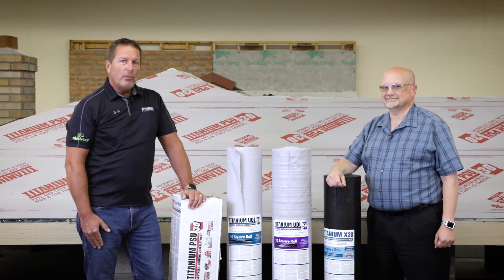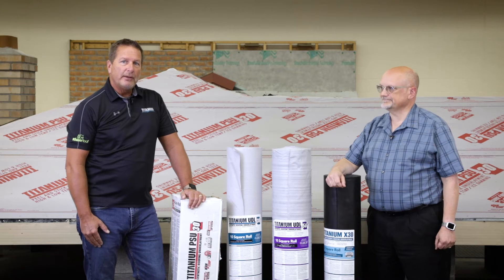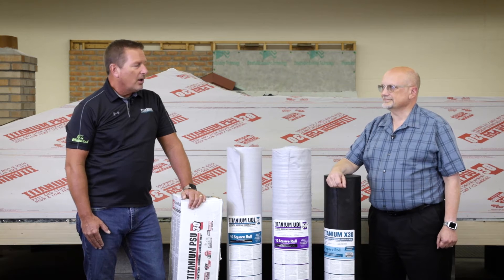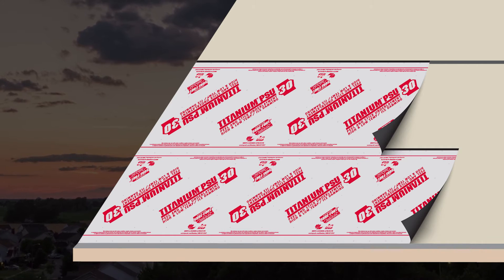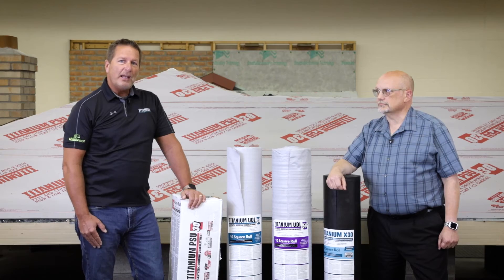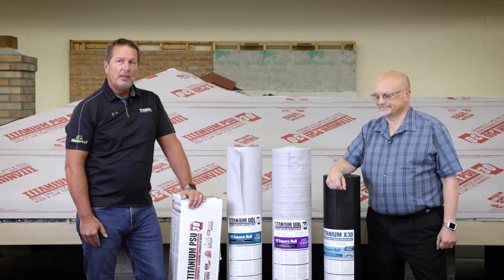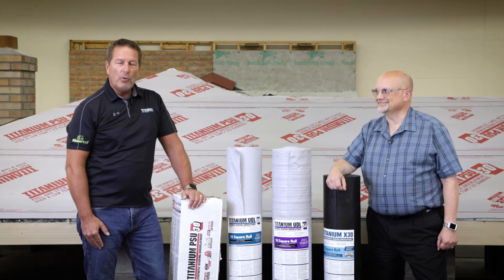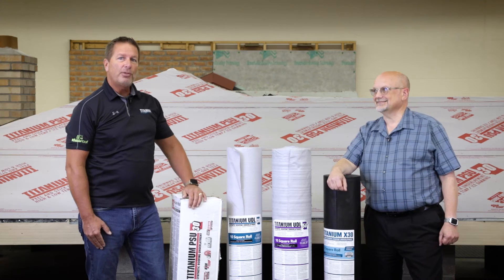With respect to underlayment in Florida, starting in 2020, the Florida Building Code started requiring a sealed roof deck system. There are three options for that system. One is to install a self-adhered underlayment on the entire deck. If you're going to install a self-adhered underlayment on your entire deck, you need to make sure you've got adequate ventilation. If you have that self-adhered product on there, moisture and moisture vapors cannot escape from the roof, and if it's sealed, it can't go down through the attic either.